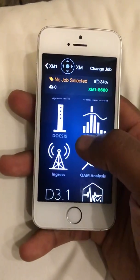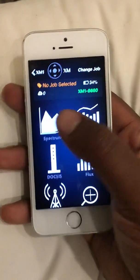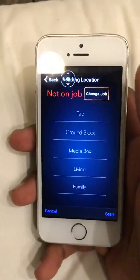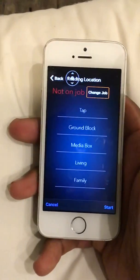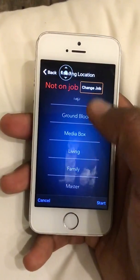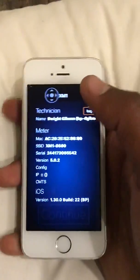The basic things you really need from the meter: DOCSIS 3.1 gives you more channels and lets you know in more detail what the signal's looking like. Your flux — you want to check that too, because the signal might look good but you're still failing. If you do the home integrity check, it might tell you the flux is bad. Here it just gives you green or red on each channel. Check each line, go to each fitting, change fittings as needed. It also could be your spectrum — spectrum specifically deals with the tap itself, the signal getting to that tap before it even gets to the house. And like I said, your channel scan: if you cannot get to the tap, hook it up wherever the feed is at — the ground block, the basement, wherever — hit 'tap' and it'll read the tap and that line. The outlet check will read every outlet hooked up in that split or on that amplifier to the ground block.